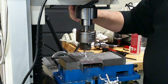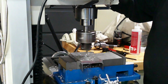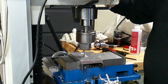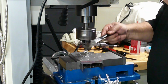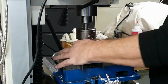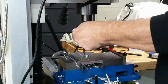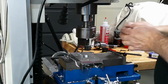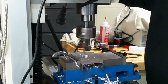After disassembling, I discovered that the set screw was screwed into the dovetail ways and distorted the ways. I cleaned up the ways with a file and fine stone to make sure the ways were as close to original as I could get them. I then made a small brass plug to ride against the ways when the screw was tightened down to keep from marring the ways again. I used a high pressure grease to lube it up and reassembled the boring head. That worked well, and I did not have any issues with adjusting the head when using it.